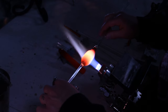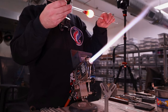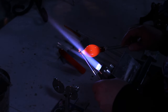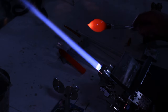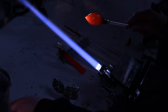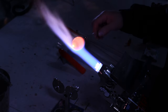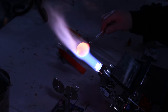I'm going to build in the best, most even heat base that I can. Herbies are really nice for this — they're known for building in really even heat bases for hollow work. I do like this torch for shaping a lot. Here I'm initiating the spin, just trying to match what I did in the handle and on the front, and then we go into the football shape — there's a nice little football shape. Now I just got to rip off all this meat from where I attached and round this out before I incalmo the ball into it.